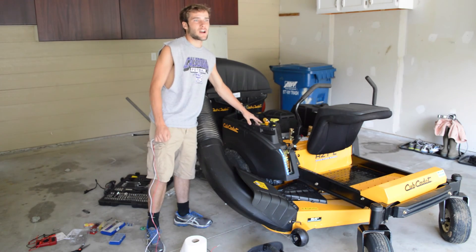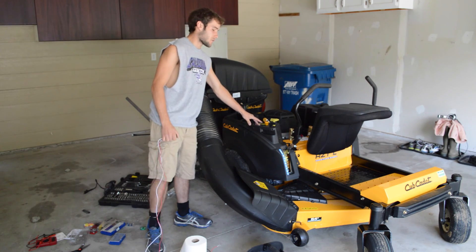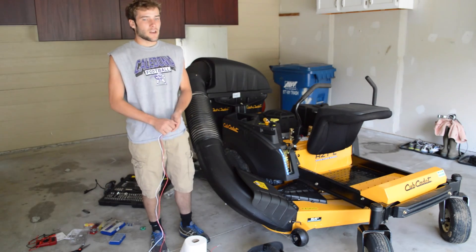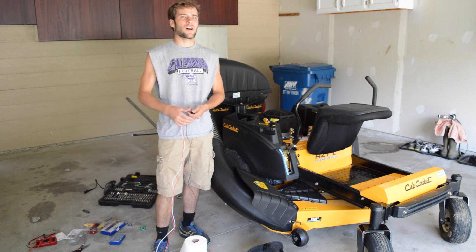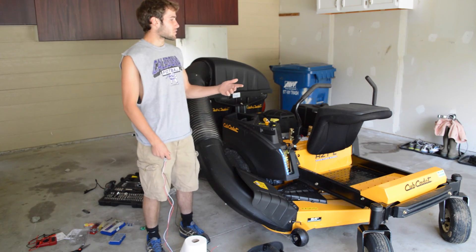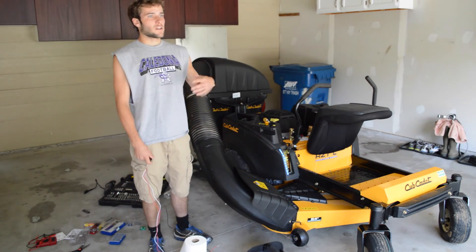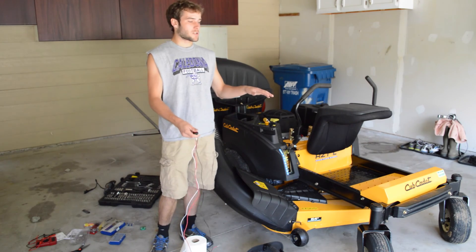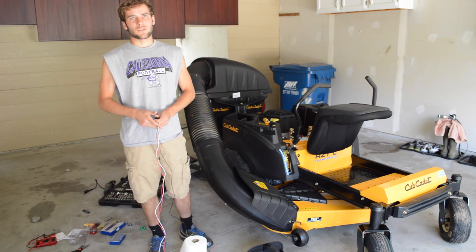The chances are pretty low because I'm running probably eight amps to this, but it's kind of just standard procedure. I'm using the ground wire that goes to the engine, goes to the magneto to shut the engine off. So if you get off the seat, or the handlebars aren't in park when you get off the seat, or the PTO is engaged, the engine shuts off. This will shut off the relay so my switch won't turn on the LED bar anymore - this is just going to stop the battery from draining.